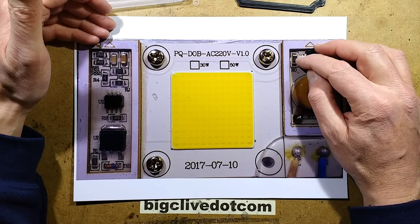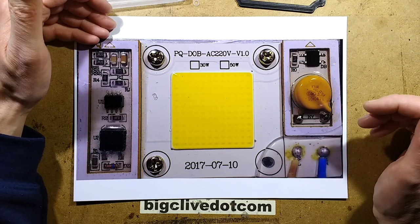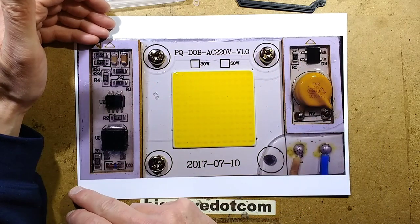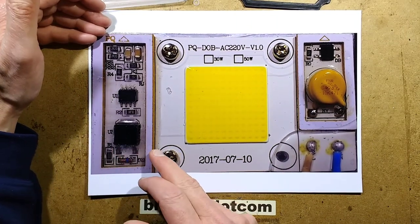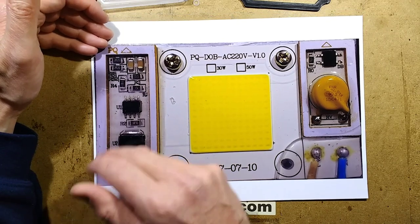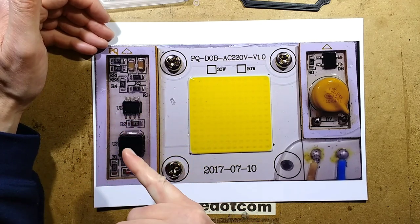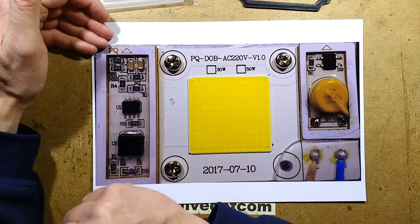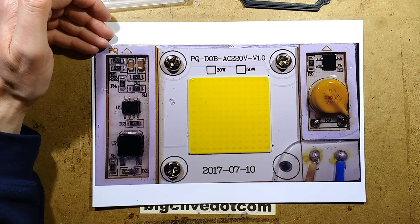There's a 7503 four-digit resistor — guessing without measuring, 750 followed by three zeros is 750kΩ. One end goes to the LEDs and the other to the circuitry. The track seems to go up to the top where I see pairs of 2.2 ohm resistors — that might be a current sense for controlling the chip, which then drives this MOSFET-type device. A couple of capacitors might be in parallel as a small power supply for the chip. The large transistor-type device has nothing marked on it — very odd.